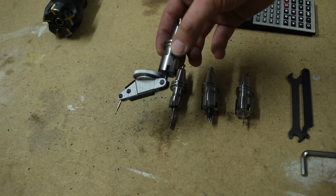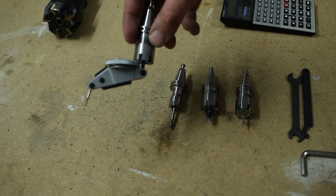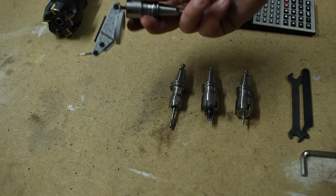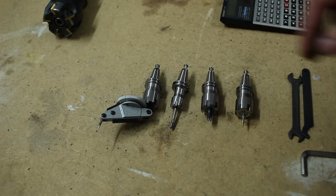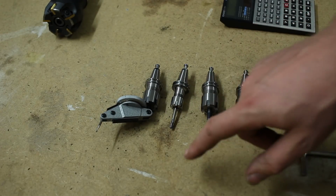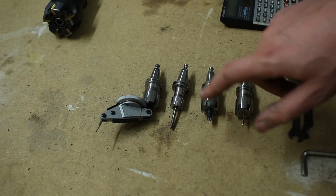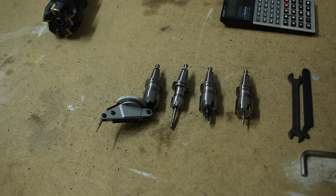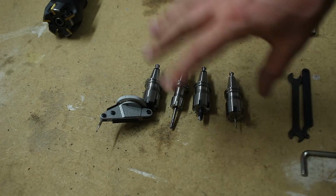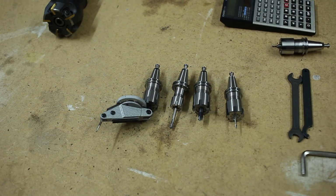This one holds my Interapid dial test indicator for centering parts, finding edges and aligning stuff. Very nice, just pop it in the spindle and go for it. Long 4mm carbide ball end mill, I use that regularly on a recurring job. 6mm chamfer end mill and 2mm carbide 2-flute PCB mill. Those are some of the tools I use very frequently on that machine.